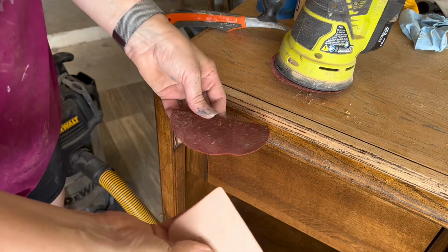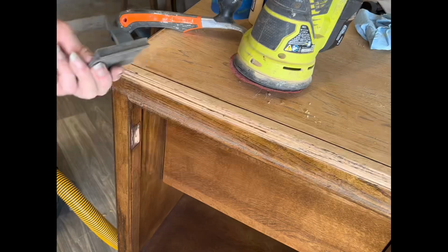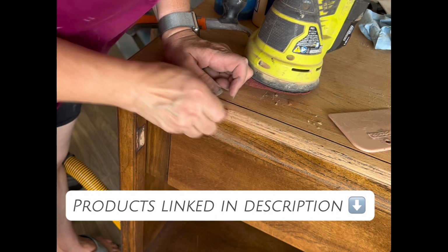So to get into some of the detail areas, I like to wrap my sandpaper around, in this case, just a little Bondo scraper. It's a flexible tool to get into those little grooves. And then I also have some sanding contours. I usually just match it up with whatever profile I'm sanding. It's a wonderful little product. They're pretty cheap and they match a variety of profiles. I do have it linked in the description, but it's a great little tool to add to your toolbox.